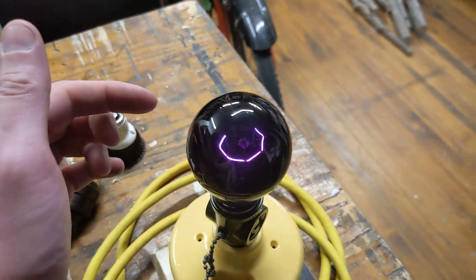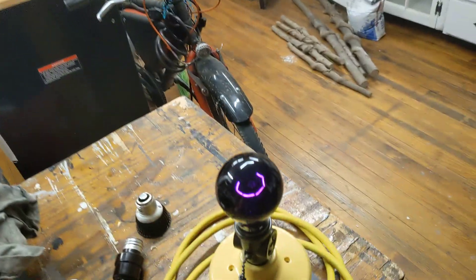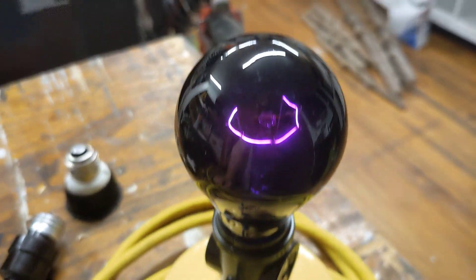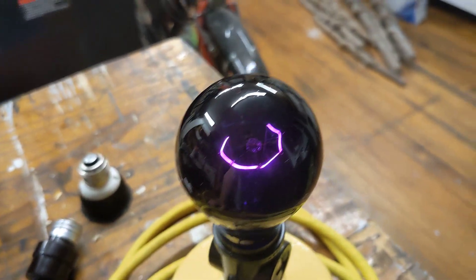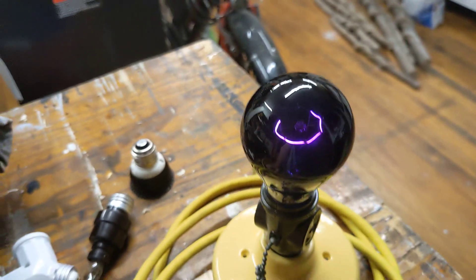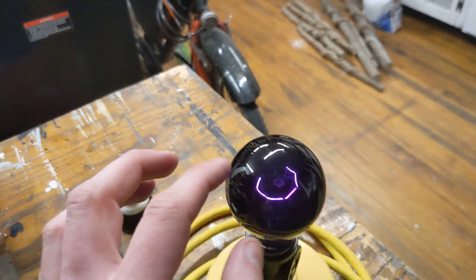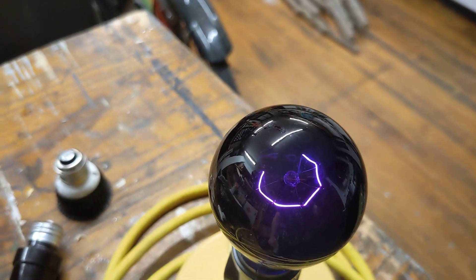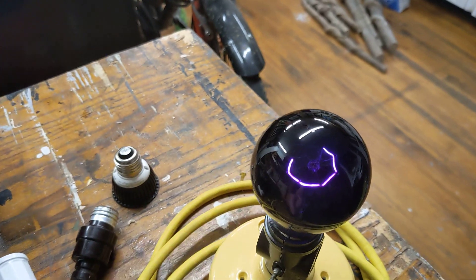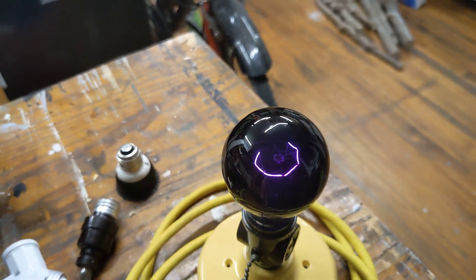What we're dealing with here is the fraction of radiation that comes off of that filament — it's a bell curve, a statistical distribution of frequencies or wavelengths of light. Incandescent light bulbs peak in the yellow range of the spectrum, while sunlight peaks in the green range. The light being emitted is in the yellow range, and we're filtering out everything except for the dark purple and ultraviolet. But there's extremely low quantities — probably far less than 1% of the energy emitted from that filament is actually ultraviolet.